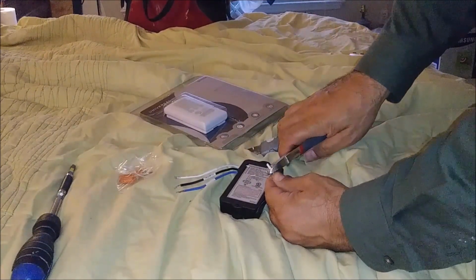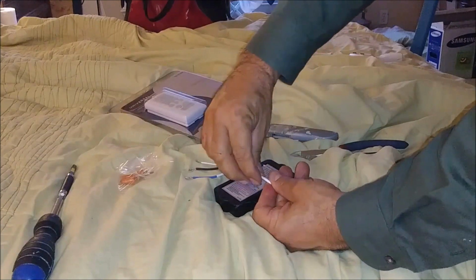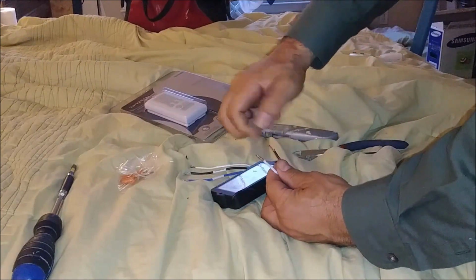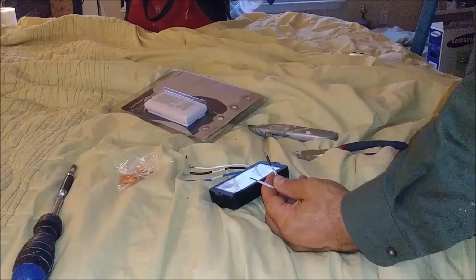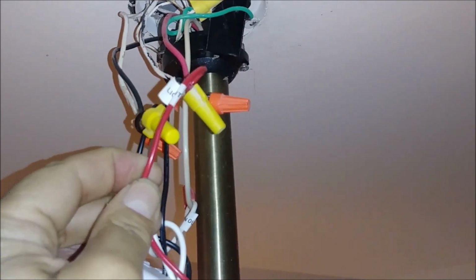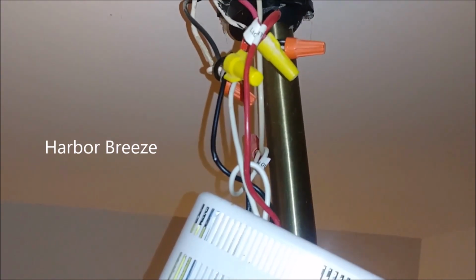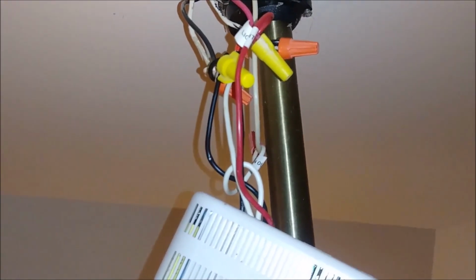Maybe use this also. Okay, so I actually have both exposed wires, and these two wires, one of them is the hot, and the neutral will go to the hot and the neutral in the ceiling. If you look again here, you can see that this is going to the light, it's the red, and the new remote control, this wire appears as blue because it's a different company. This is a Harbor company, the other one is Freeze something company, so they're just using different colors, but they should be universal, so it's not going to be any problem.